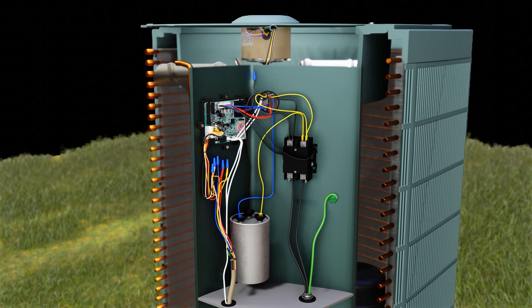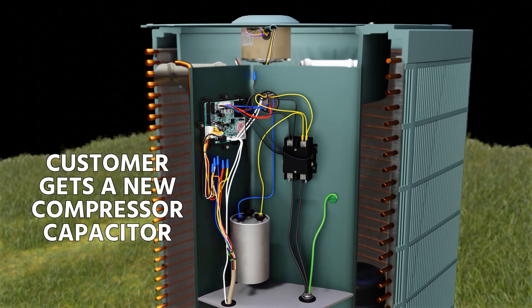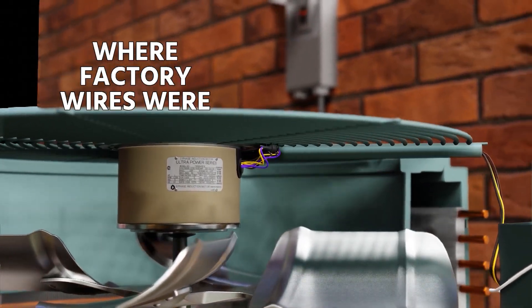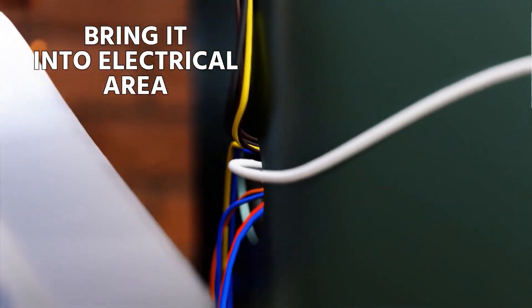But a lot of times that's not convenient, because you're replacing the factory capacitor with another dual capacitor. That's one really common case, and that's generally what I prefer doing. That way, the customer also gets a compressor capacitor as well. So generally speaking, you're just going to cut it back at the motor, put a wire nut on it, or you could run this wire back into the cabinet and cut it and cap it there.